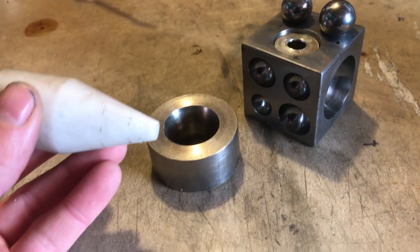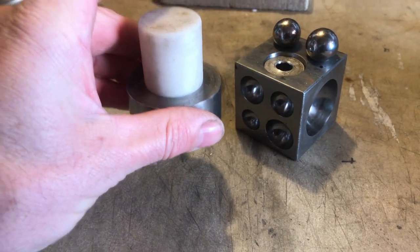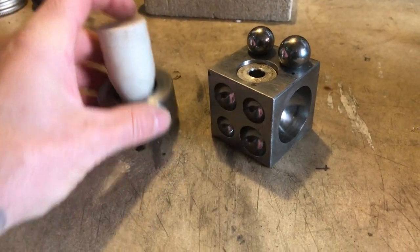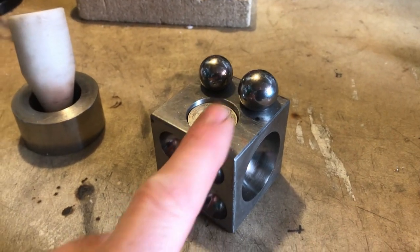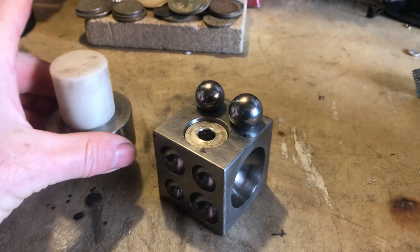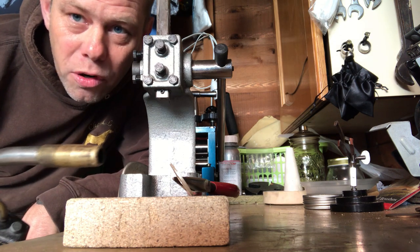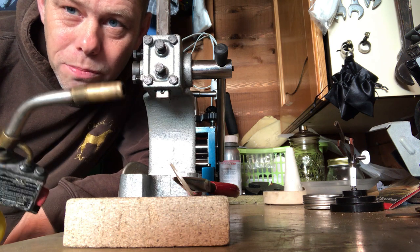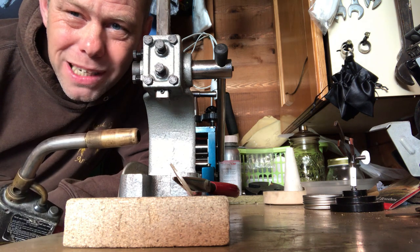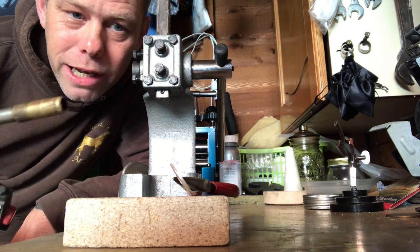You start it off with the doming block and use the little steelies to get it halfway into the shape, then put it through the 17-degree die to get the edges all flush. But first — nearly forgot — you've got to anneal it. Once you've punched it and deburred it, before you start making the cone shape, you need to heat it up. You don't want it bright red as that'll blister the coin — you want it just to go a pinkish colour.